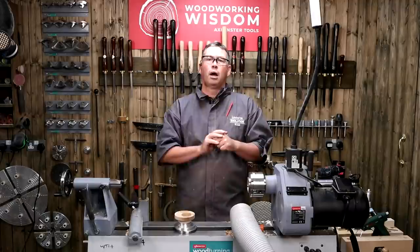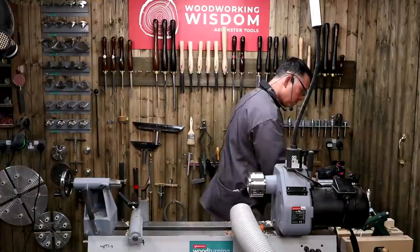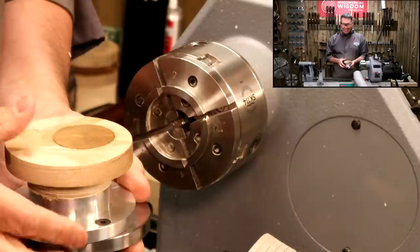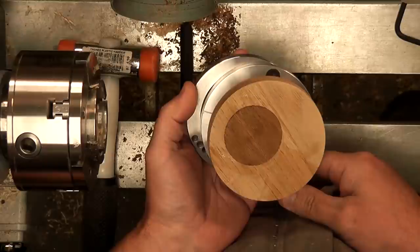Question from Maria about the UJK dovetail jig and box joints: you never flip over the board — it's always only changing end to end and you're always against the side stop, machining fingers on the left-hand side first and then using those fingers to set up the side stop on the right-hand side. If you need any more help with this, just drop us an email — perhaps include your phone number and I'll give you a call and talk it through.